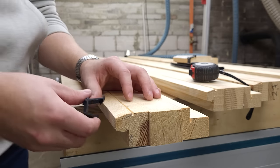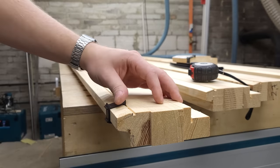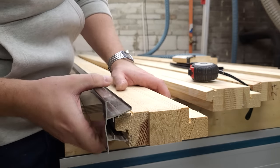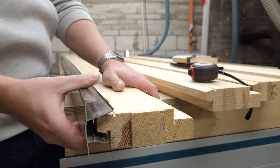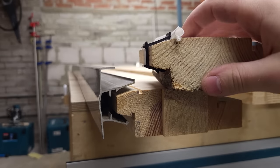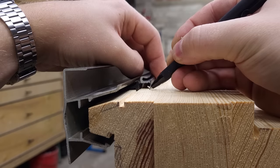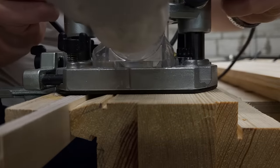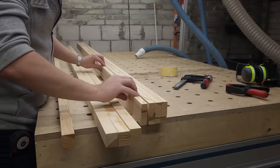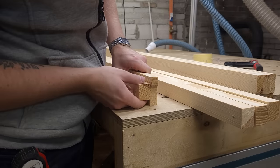On the old frame the seals were paper thin and pretty much useless, so in my new design I tried to find the best seals I could get. I probably read through countless pages of specification data for weather stripping. Most of the high-end strips are all routed in, and I don't think I ever want to mess around with the adhesive ones ever again. I probably ended up spending around $100 for all the seals in total, which is definitely on the higher end for just one window.